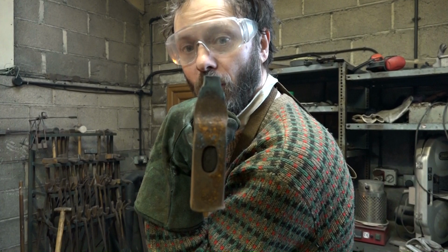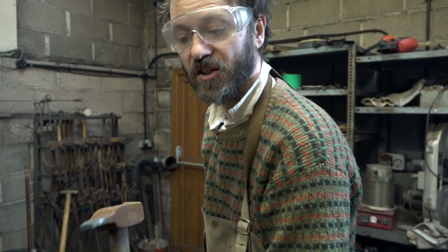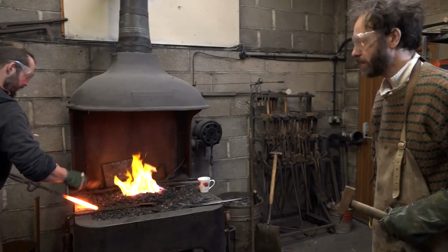And you see, it goes straight for a bit and then it widens out. So I'm gonna have to hammer all the way through to put a hole in and then go a little bit further to create a bit of a widening, which will accommodate the width of the tang. It's a little bit approximate. I've been told that it's best to go not quite far enough so that the blade is too tight, rather than to go too far, so that the blade is too loose in the quillons, because tightening it up is a swine.